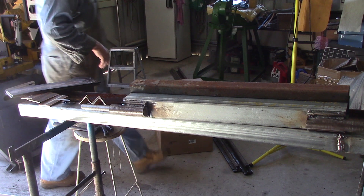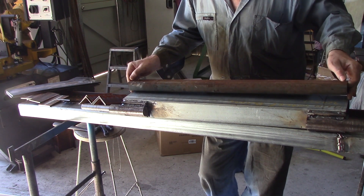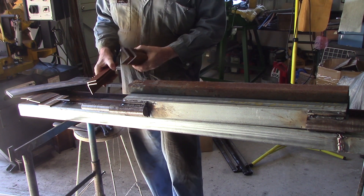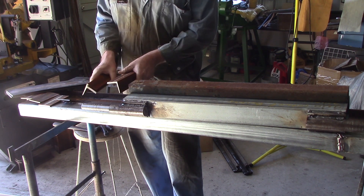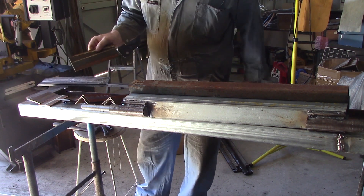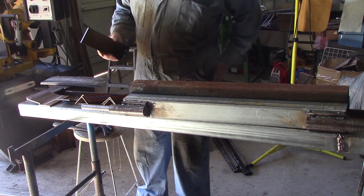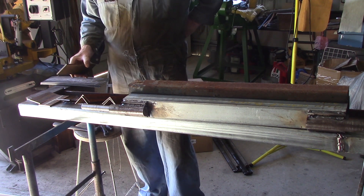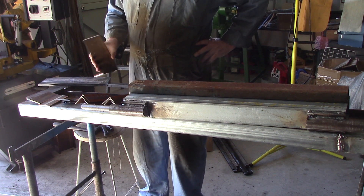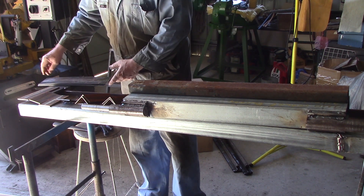Now I've got all the parts cut for assembling the trailer part. The main shaft of the trailer is outside but I've got the broad cross member here, that's part 015. I've got the cross member assembly which we've already made, A02. I've got the engine mounts left and right and the oil tank supports — they're all exactly the same until I drill them, then we get a left and right engine mount. The plans call for 6mm by 75 for the center hinge. I've got 75 by 5mm so it's only 1mm shy, and it lets me use up a piece. I'm pretty sure that'll work.